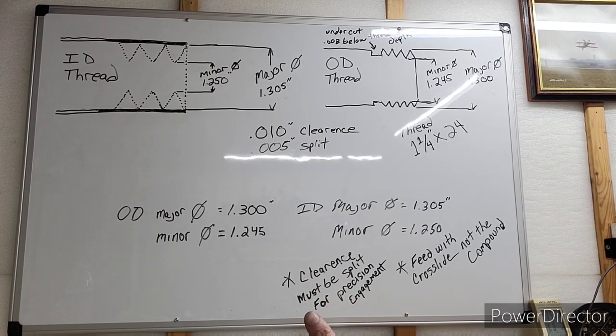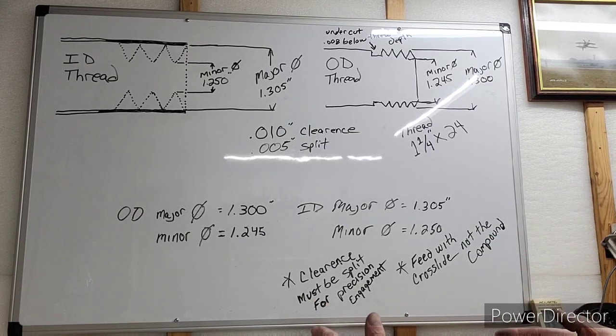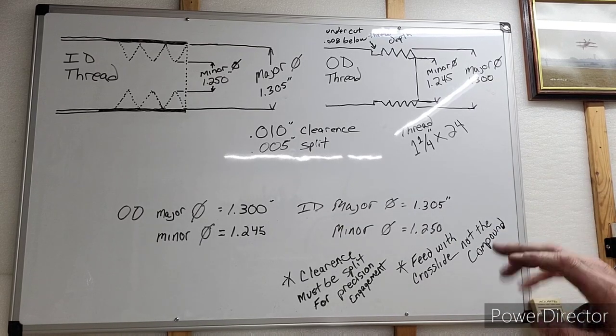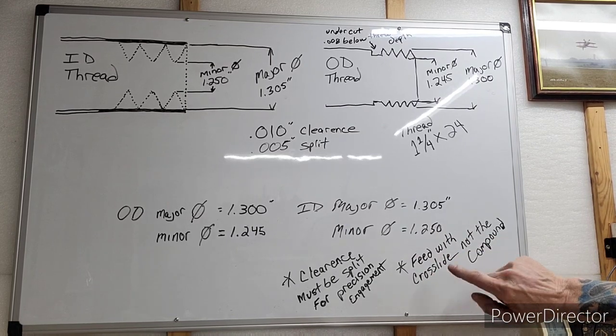They're explaining it as you use the flank side of the threading tool, giving the right side flank a little clearance as it's running, chasing the thread. And they're teaching people that you turn in with the cross slide or the compound. No, you do not. I set my compound at 29.5 degrees, but I feed in with the cross slide.